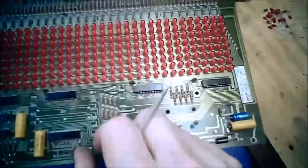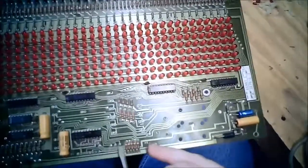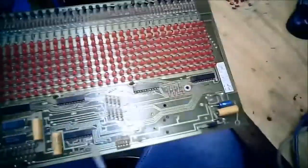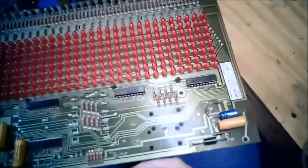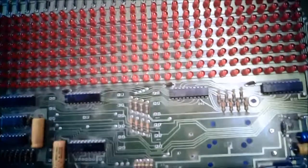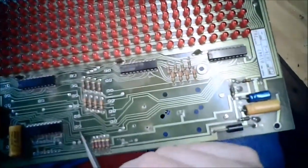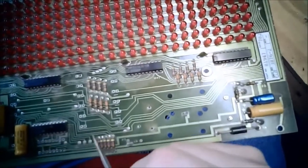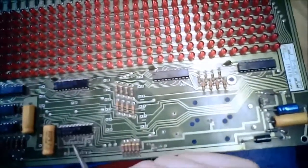And then these two here go nowhere. So there used to be a little 3-pin header, just from the size of these pads and their spacing. I bet there's a ribbon cable header here that could be expanded to something else, which was never populated on this card. Let's see, does any of these other ones go anywhere important? Won't see anything. These go down to there.